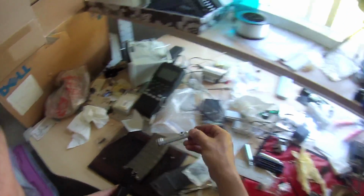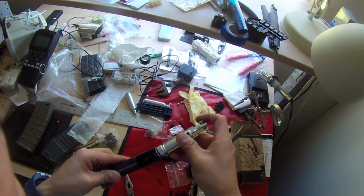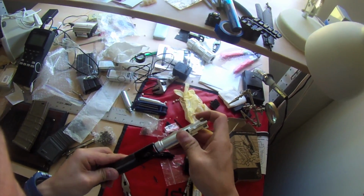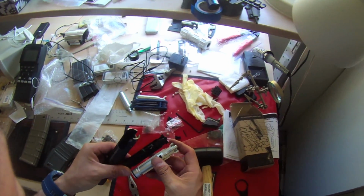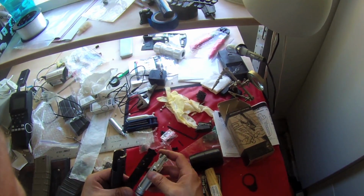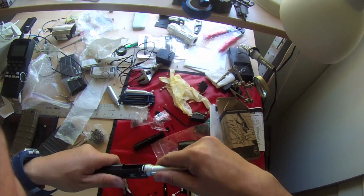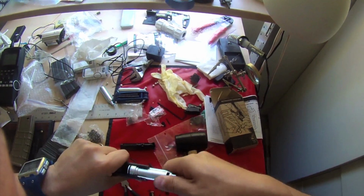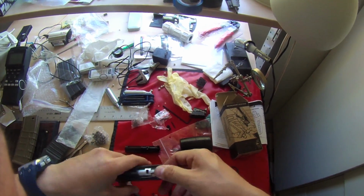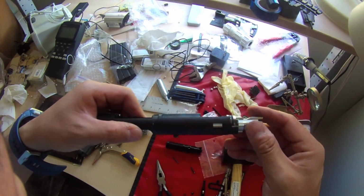One thing I noticed, the RA-Tech nozzle is actually a little wider. It was a little hard to push into the bolt carrier, and it does look like the RA-Tech nozzle is a little wider, not too much wider. Eventually I got it pushed in, and a little grease and silicone spray helped.